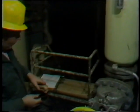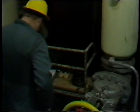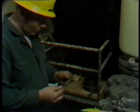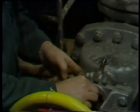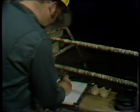In this example, the packing is supplied in bulk form, so the first job is to cut it into lengths of the appropriate size. To double-check the number of rings needed, the workman measures the depth of the stuffing box by inserting a small ruler, then divides the stuffing box depth by the size of the packing. The result of this calculation is the number of rings to install, which in most cases will be the same number he removed.